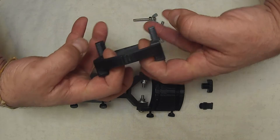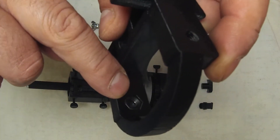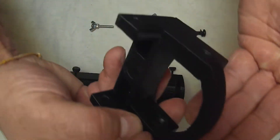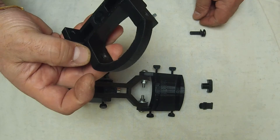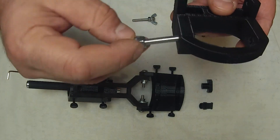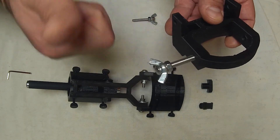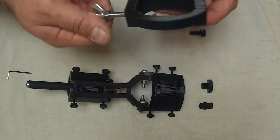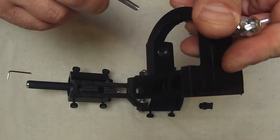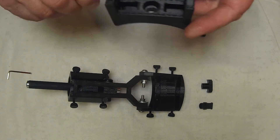Here's the azimuth adjuster with wings that I put on, as well as a bridge over the top to make it very strong. I'm showing that you insert M5 nuts and you can use a wrench to tighten them in place — there are slots for them in the azimuth adjuster print, and they'll pop right in and stay quite well. That gives you a place to put your M5 bolts. I put a little wing nut on them with another nut to lock it in place for an easy twist. That handles the azimuth adjustment and works just like it would on any other EQ mount.